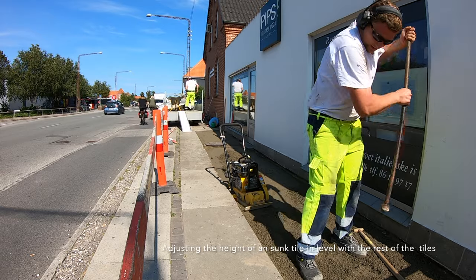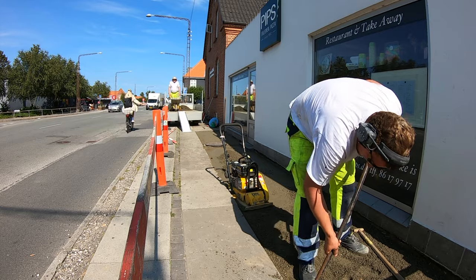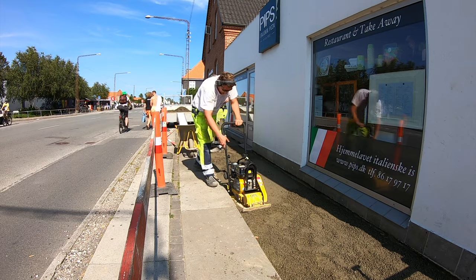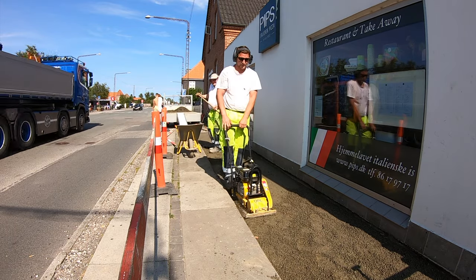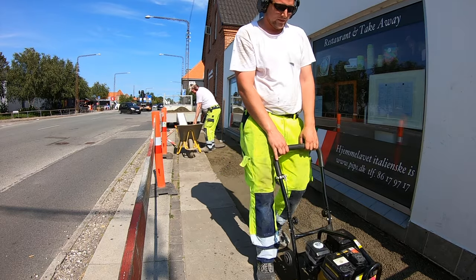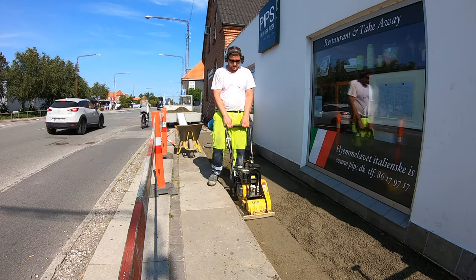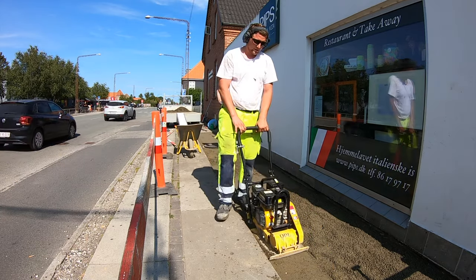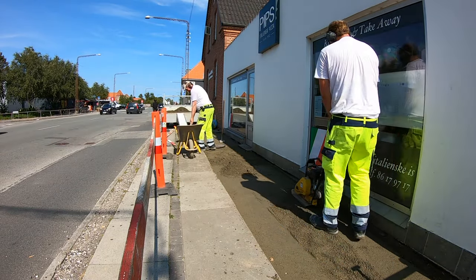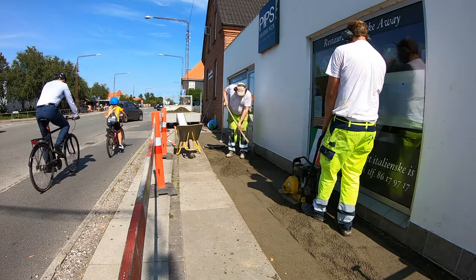If the underlay where you want to pour the asphalt is an impermeable substrate, for example clay, you need to make sure it has good drainage for water and that you use proper piping to ensure that is done right. Otherwise, if there is a big storm and the water sweeps under the asphalt and a car or truck drives over, the soil acts like a plastic foil, keeping the water just between the asphalt and itself. Even if you have gravel on top of the clay, if the water is not going away, at some point the gravel will get saturated with water and start acting like a wobbly surface — the asphalt will most certainly crack or get damaged under the weight of the car compounded with the softness underneath.